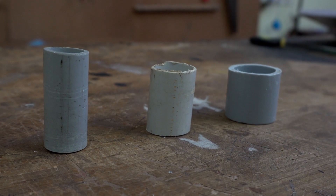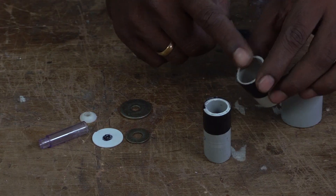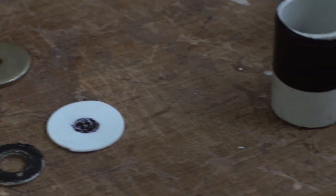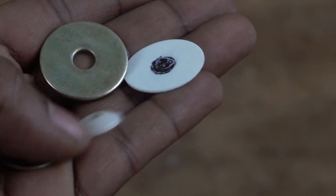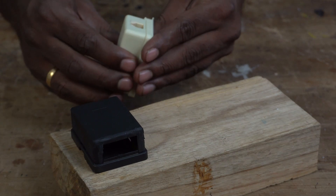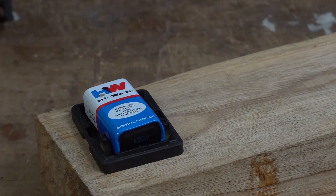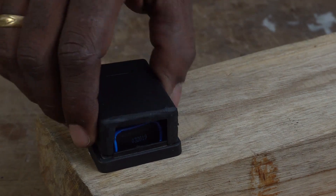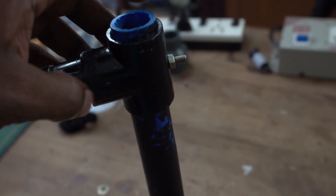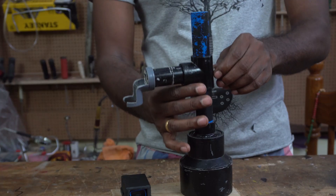The PVC pipes are cut to length — measurements are in the description if you need, but this is very much based on the lens that I have at the moment. To cover the top part and make the lens holder, I improvised with whatever I had, apart from the plastic sheets I cut — washers of various inner and outer diameters. The base is made with a spare 2x4 wood, which is good and stable support for this project. The headlamp was a bit bulky so I decided to make a simple LED light. The black box you see here is a telephone connector with all its internals removed, and it houses a 9V battery and an LED with a switch. For mounting the lens to the handle, I made a groove on the PVC. By sanding the interior of a T connector, it could now freely slide over the PVC. By making a hole in the center and adding a wing nut, the height can be adjusted.